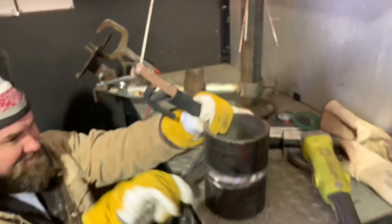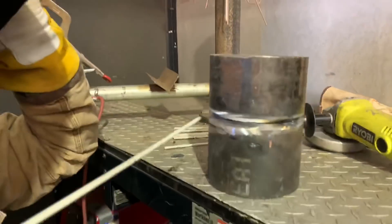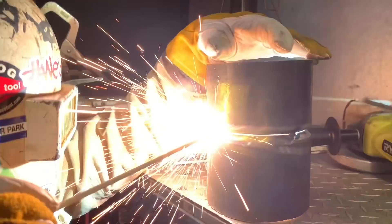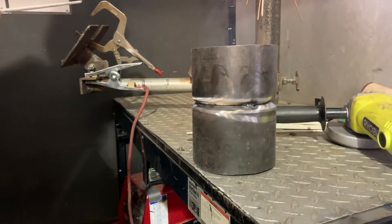It's probably 10 times faster than the jacking method. It's just like downhill, but you're running uphill. You're going to have to have a good machine — a Lincoln or something with some good arc force. If you can turn the arc force up and once you get it to pop through to the inside of the pipe, that arc force will grab that rod. I usually just hold it with one hand — you can feel it, it's like nothing else. It just grabs that rod and pulls it. You could almost just let go of the stinger and it would weld itself if you have the settings right and the landing and the gap. Once you've got it down, you'll never forget it.